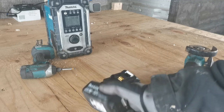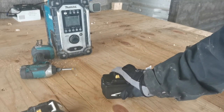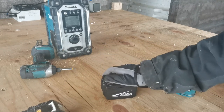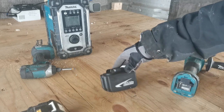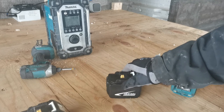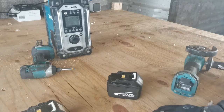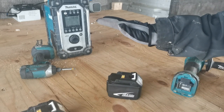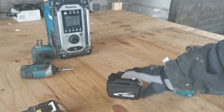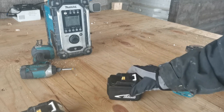So keep in mind, if you buy this, the original batteries have a balancing board, this doesn't have it. This is the biggest problem with this cheaper board. I hope that if I give the feedback and the right board, they will switch it up, and this will make those batteries, oh my god, really good. If they add the balancing and the short circuit board in this one, it's as good as it can get, near the original one.